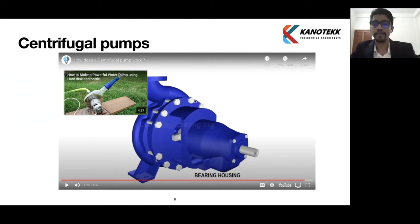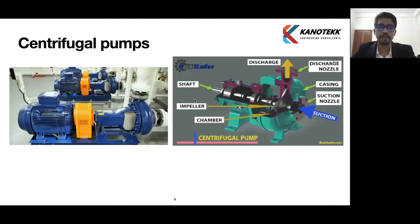That was about centrifugal pumps in the video. The first picture is a centrifugal pump installed at site. The second describes the parts inside the pump — we can see the suction side and discharge side. There is an impeller, which is the one that churns the water, and a shaft which provides drive to the impeller. On the other side there can be either an electric motor or an engine for providing drive. There is also a casing for the pump, as seen in the video.